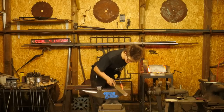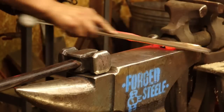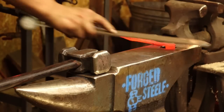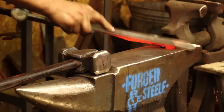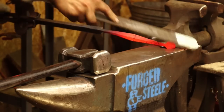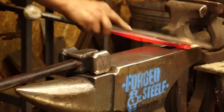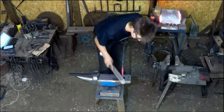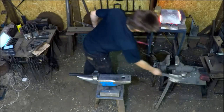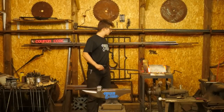What I'm looking at here is a little bit of impurities from the forge. As you use a gas forge, in my experience, every time you put the piece of steel in the fire, the scale jumps off it as it reacts to the heat change, lands, and forms a puddle. And then that mixes with the slight layer of refractory that eventually breaks down and melts.